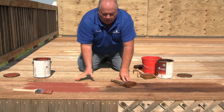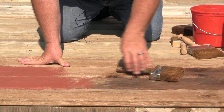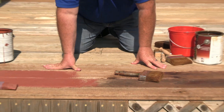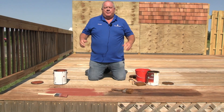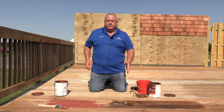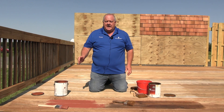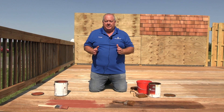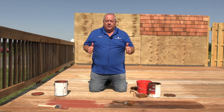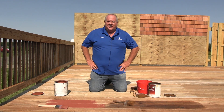Just to recap: don't lift your brush, keep a wet edge all the way across, and you won't have any dry marks. If you let it dry and come back over with another coat, that will be a lap mark. I'm Everett Abrams, the Wizard of Wood — thank you for watching. Use the right brush for your sealer, use a different technique than you did with painting, and you won't leave brush marks or lap marks. Any questions about the procedure, leave something in the comments, and don't forget to subscribe to our channel.